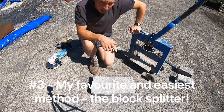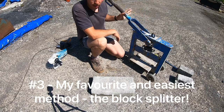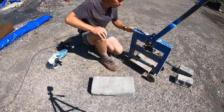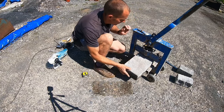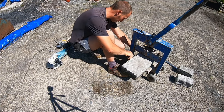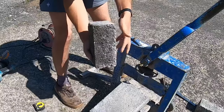The next method is the block splitter. All that happens is the block slides in, and these two plates are what cut the block. The top one moves and forces the plate down to meet the bottom one — these are spring loaded. You can either mark the block first and put it in, or mark the block while it's in. These are old blocks so it'll take a bit more force on the lever. We'll look at 100mm, sight down to make sure it's square in the cutter, and just pull the handle. And there's no trimming with that.